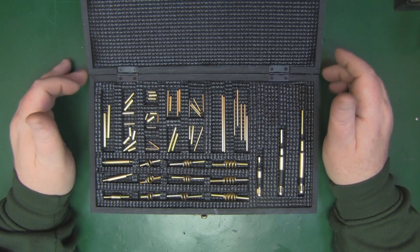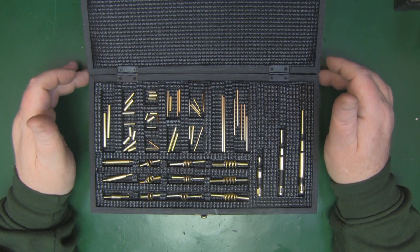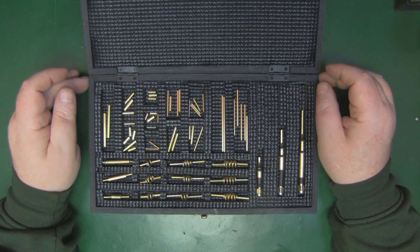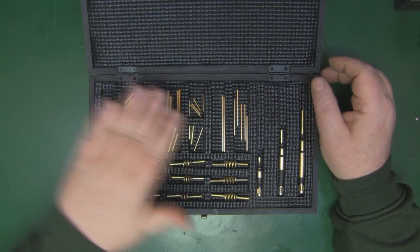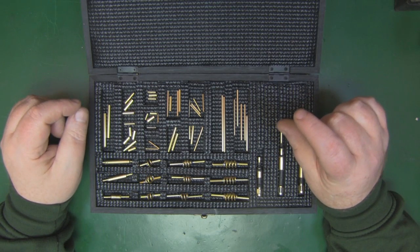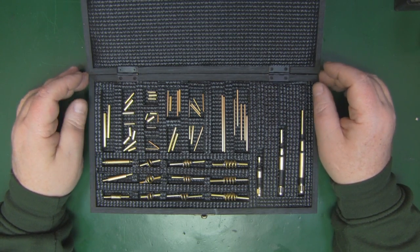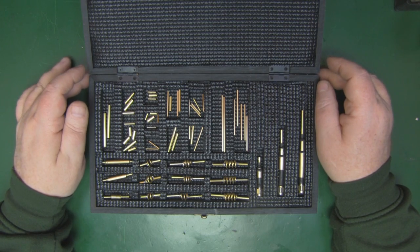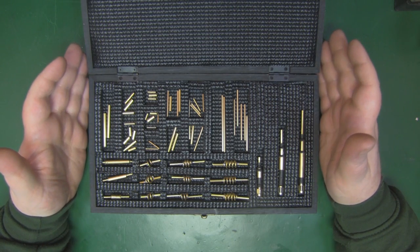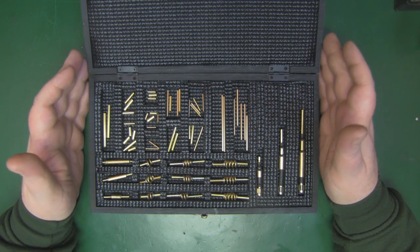And then a couple of years ago I was watching a video of a fellow YouTuber, ElPaso TubeAmps, and he had a couple of antennas there that he was using as a reference. And he had a flat ground plane and an adjustable dipole on that ground plane, and he also had an adjustable dipole on a cantenna as well, to try and get the perfect VSWR and frequency response of that antenna. And this is basically what I've come up with, using those two ideas as an ultimate idea to create a dipole development kit.